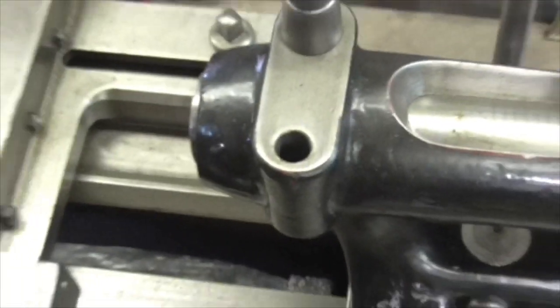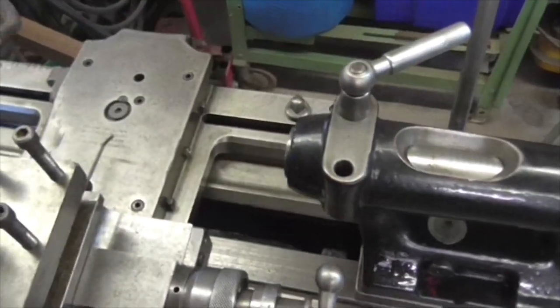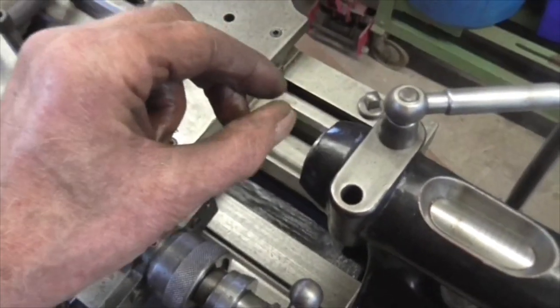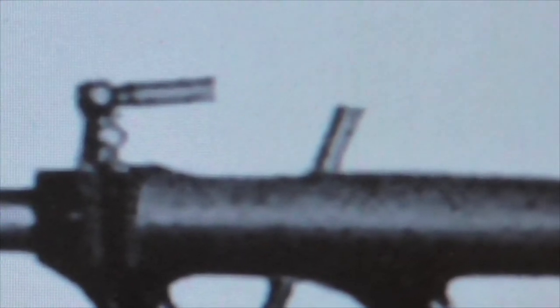Here's a thing — there's a nice little hole there matching that one. What's it for? It's for the little dipstick. There should be a little dipstick slotted in there with a round ball on the end — you fill it with oil, lift the dipstick out, put some drops of oil in your centre, and pop it back in. If you look carefully on the screen, you can see it: it's got a little taper on it and a ball on the end, slots in there, filled with oil, and you use it to put a drop of oil on your centre when you're turning. Right, I shall make one.